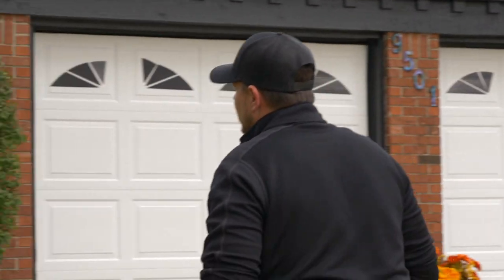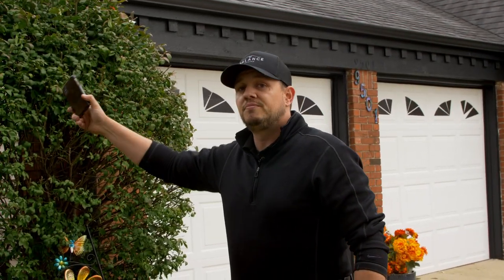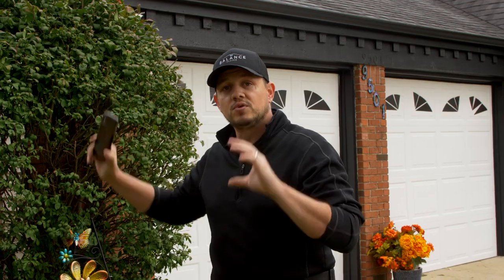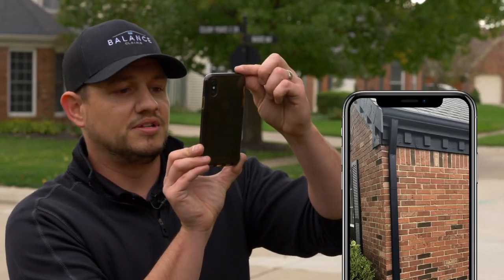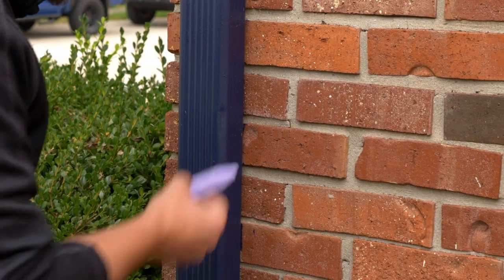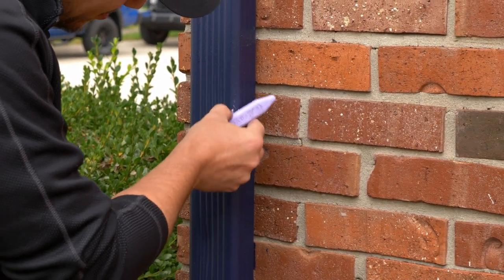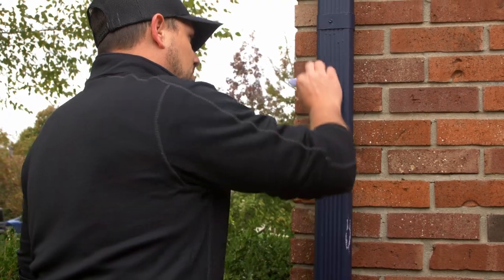Coming to the edge of this elevation, we're going to move to the right elevation. Before I get started on close-ups, I'll get my overview, though there's a fence blocking part of it so I'll do the best I can. I'll also go to the other side of the fence to get a picture from the other way for a full overview. There is damage to this downspout — I am seeing some hits on it. It's a rinse-and-repeat process: get your standoff photo, come up to the gutter, find your hits, mark them so they show up better on camera. These are actually pretty good hits.